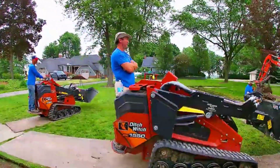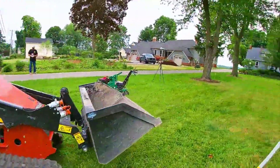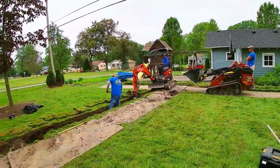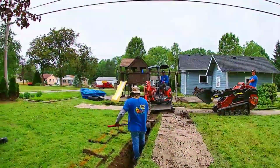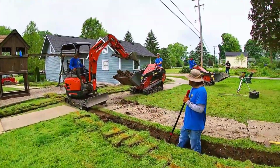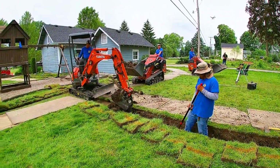But I'm telling you, whatever you're deciding to buy for a dump trailer, whatever you're deciding to buy for a dump truck, step it up. Make sure you overhoist it too. We've had a lot of special dump trucks built over the years, and we just overhoisted it. That's something you can ask the fabricator to do. Step it up to the next size hoist so you're not in the back of that dump truck shoveling it by hand, which is just an absolute nightmare.